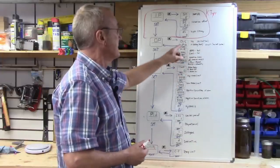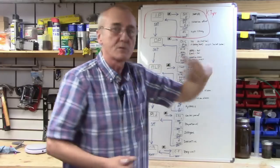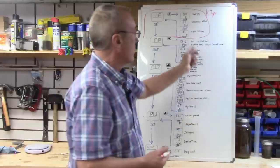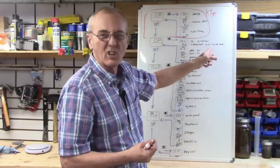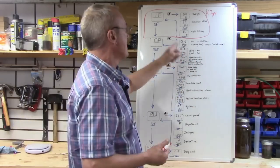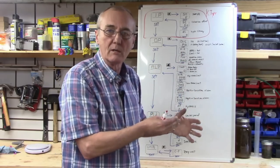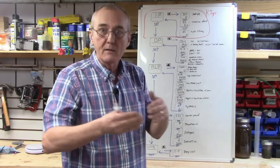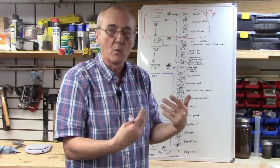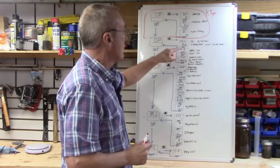Push the left arrow button to get to the first page of OP — CTRL (control mode). Set this to PID. If you scroll with the up and down arrows you'll also find AT for auto-tune, a factory reset option, and an off-looking symbol for on/off control. We want PID mode, not on/off control. Some people call wondering why it doesn't work, and it turns out they had it set to on/off — so make sure it's in PID.